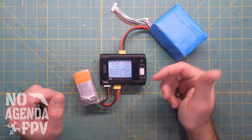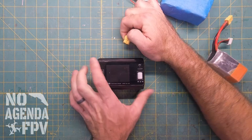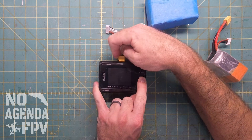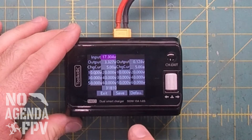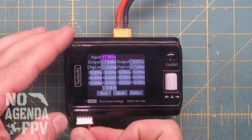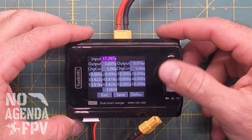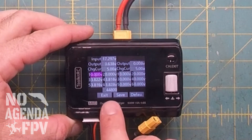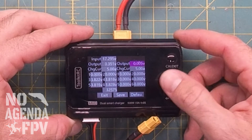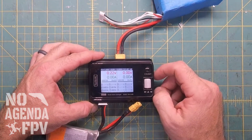I hope that was helpful. If it was, comment below. Real quick, I'm going to show another feature I figured out on this: if you press this button and then plug in — which is hard to see — it'll come up with a calibration menu. My charger needed tweaked a little bit. I read the voltage with a multimeter I know is good, then looked at what each voltage reads per cell here, and even moved it over to check all six cells. If you go to the cell you want to adjust, you can see the number — 44,800 — and clicking it allows you to change that number. That's how you adjust your calibration. You can go through all of them and save, exit, or go back to defaults.